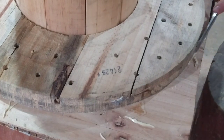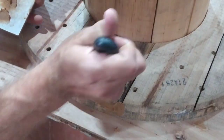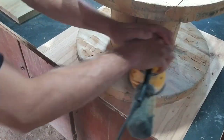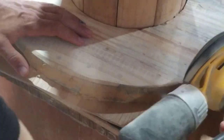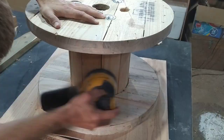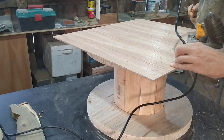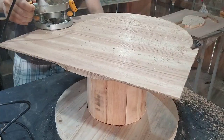I had to clean up the sides nicely and also cover any cracks or holes on the sides, because I wanted to route the top four millimeter plywood and make the sides smooth so I could make a nice flush trim with the router. Using a straight flush trim bit, I trimmed the sides.